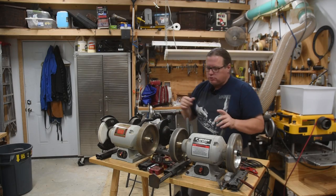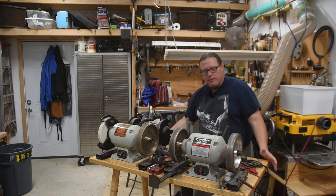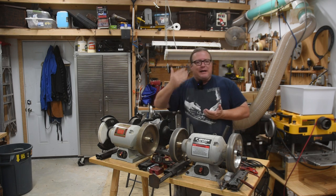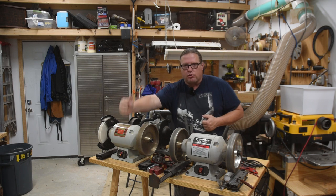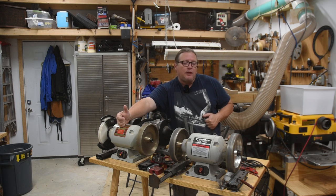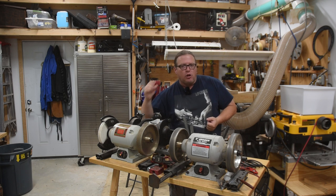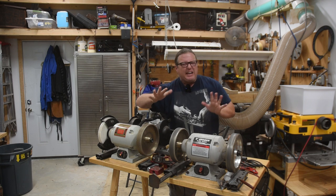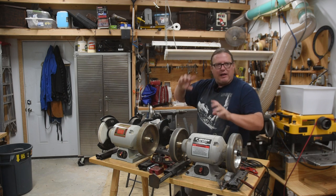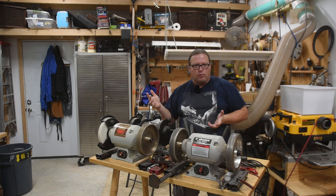I'll start by explaining what I have right here. When dad and I combined our shops, we combined our sharpening setups and I built this table — I'm not really happy with it, so we'll be doing something different in the next few weeks. I basically had three 8-inch grinders and one 6-inch grinder. One 8-inch was a Delta I bought when I first started out; I didn't really know what I was buying and got a regular grinder. If you're a wood turner, you really want a slow speed grinder — around 1,700–1,800 RPM. Most grinders are built for metalworking and spin a lot faster. I have that other 8-inch on the shelf as a backup, but it just goes way too fast.